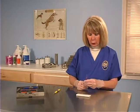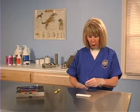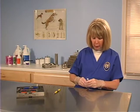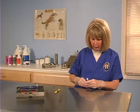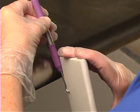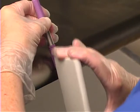Place the dull instrument to be sharpened perpendicular against the table, with the face of the blade facing towards you. Grab the number 4 Arkansas flat stone, place it flat against the blade, opening it out to a 70 to 90 degree angle to maintain the internal bevel, 2 downstrokes. Turn it to the other side and 2 downstrokes.